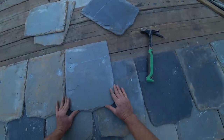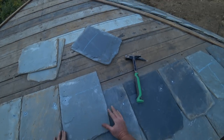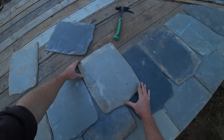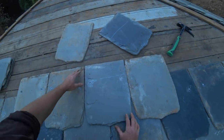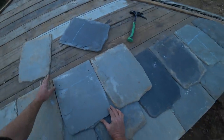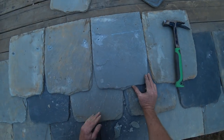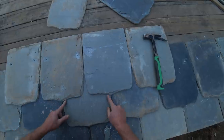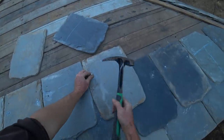I pretty much want to go with the points lined up, but this one's a little off - there's kind of a gap over here. I'll take the next slate, lay it out and see what it looks like - that looks good there. If these points don't line up with these cracks the roof just doesn't look right. A few of these slates are a little bit short, so I'm going to eyeball this and make it look good rather than just arbitrarily go by the line, so we can make some progress now that the first course is done.